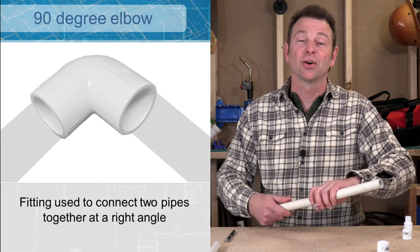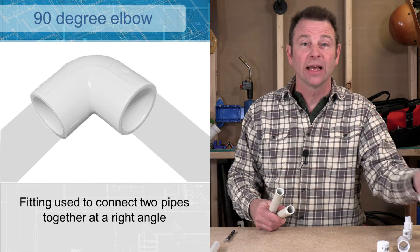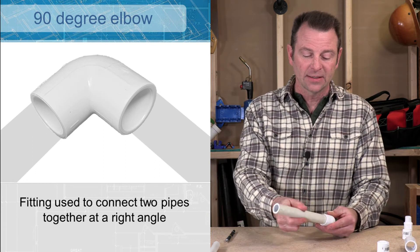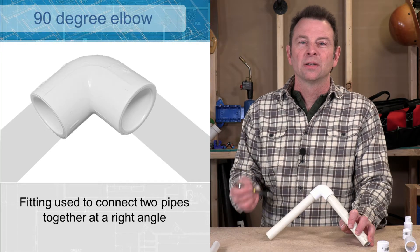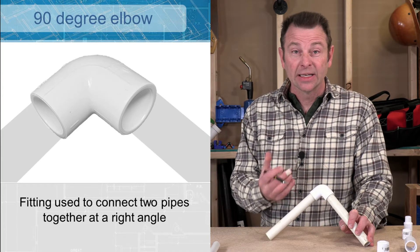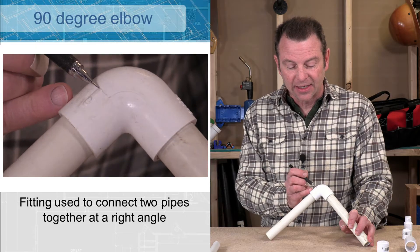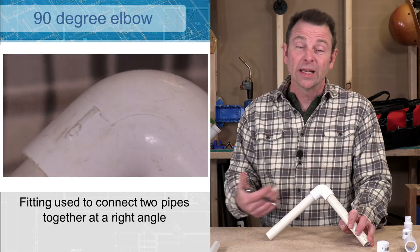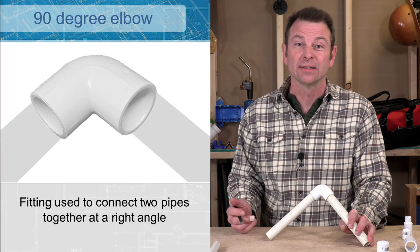You might need to turn a corner with a pipe. You can use a 90 degree elbow to do that — a slip fit on either end and now we have a 90 degree turn. If we take a close look at this fitting, this slip socket is made to accept this pipe. The pipe will slide into this socket and it should bottom out right about on this line right here. When it does that, that's the guarantee that it's a sturdy watertight seal.